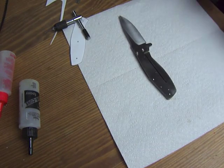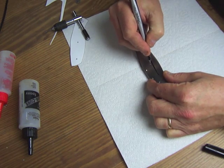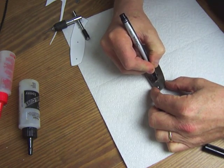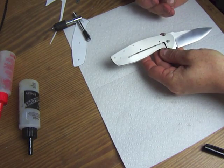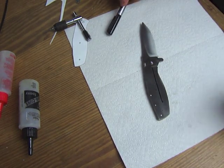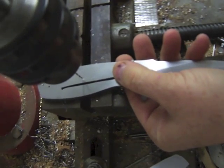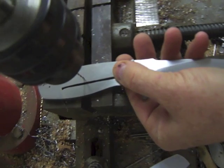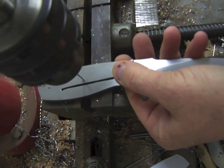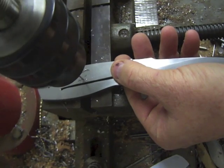I'll start that with a punch and then just drill through both sides of the knife scales. After they're marked, I'll take a thin Sharpie — a permanent marker pen — and make some marks right where my little scratches are, and this will make it a lot easier for me to see when I start these with a punch and then drill those out. I'm going to use three 6-32 countersunk machine screws, black oxide finish. I'm drilling right through both of the handles while the knife is assembled. Even though I used a punch to start this, the drill still wanted to wander a little bit, so you do this very carefully, drilling first with pilot holes with a very small drill bit just to make sure that I go through straight.